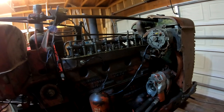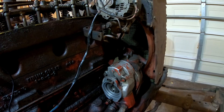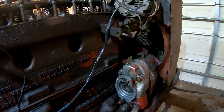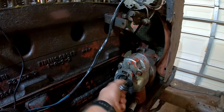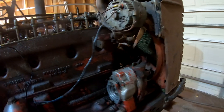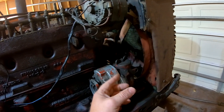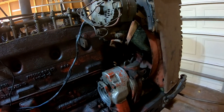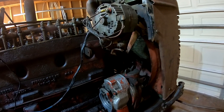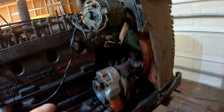The second issue is the live hydraulic pump where the distributor bolts on. The distributor drive out of the live hydraulic pump has about a quarter to three-eighths of an inch of rotational play side to side, which is not good. That tells me there's either a problem with the gear driven off the camshaft, the key the gear is pressed onto, a sheared or severely worn key, a severely worn gear, or missing teeth somewhere. I really don't know yet.